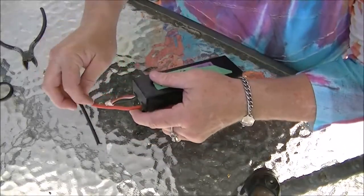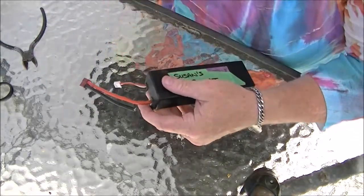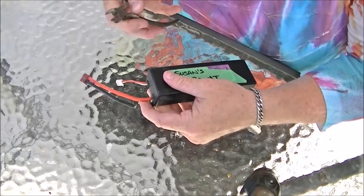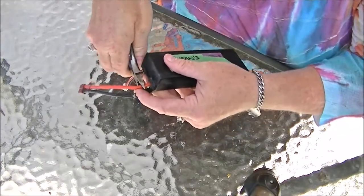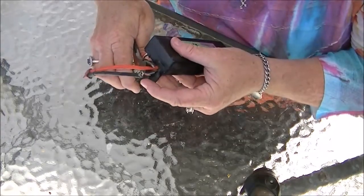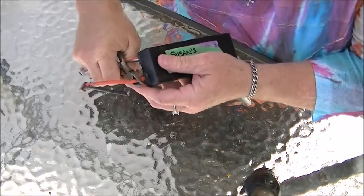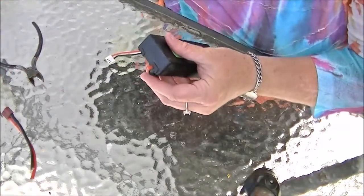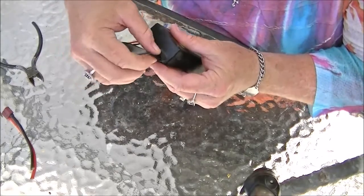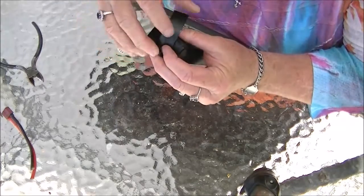So the red one — I'm going to cut it a bit longer simply to get the most mileage out of it so we can use it for something else. It also leaves it as a different length than the black one. Okay, now again get electrical tape and seal that sucker so it can't possibly spark against anything.